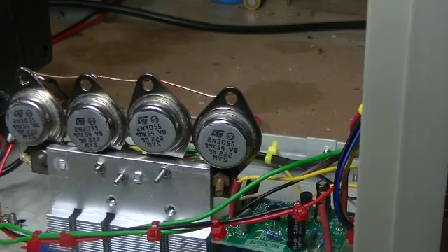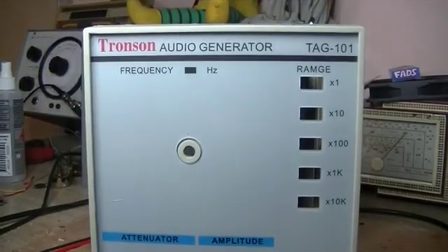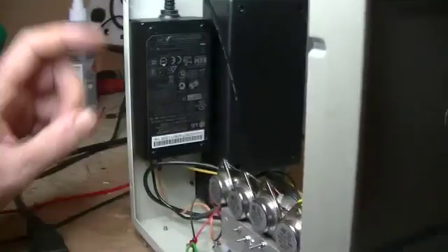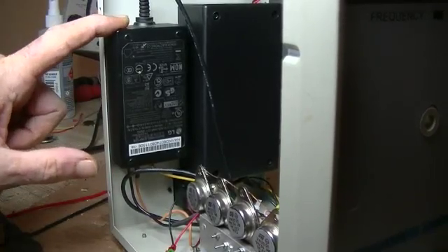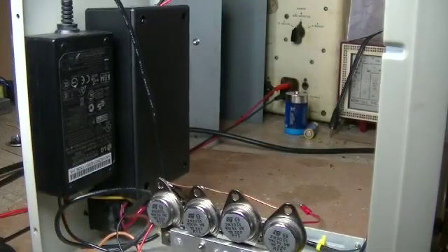I'll show you what I've done. If you remember my old audio generator — the Tronson — I'm not going to fix that, so I gutted the case and put everything in here. I'm using a laptop battery charger, an LG 12-volt 2-amp supply. The little black box next to it is my signal tracer, which I had to repair — I'd pretty much burned out the germanium diode last time I used it. Got that sorted, and mounted it all up.